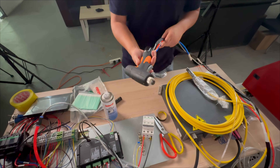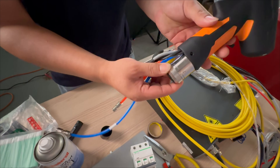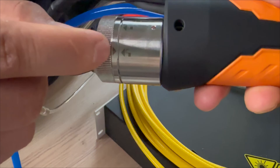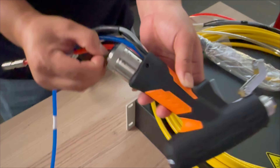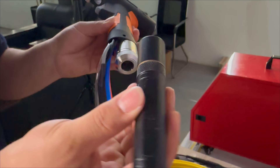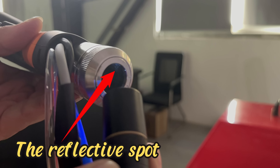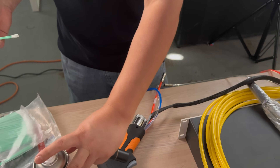Next, let's connect the gun head and the QBH part. First, take out our gun head. On the gun head, we can see there is a lock here with an arrow. Before starting, make sure the triangle arrow aligns with the unlocked position. Then open it. We need to check if there is any dust inside. Use the UV light to check for dust inside — if there are reflective spots, we need to wipe them off. Use our cotton swab.